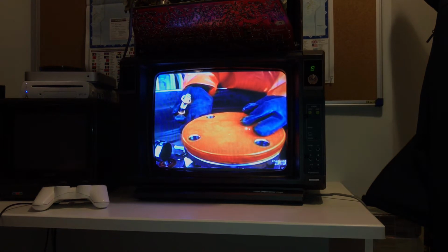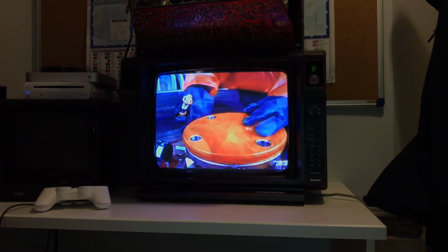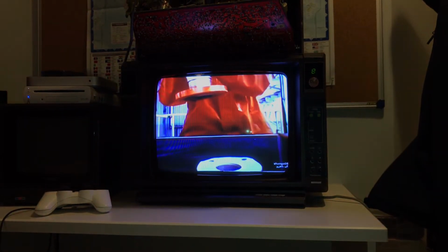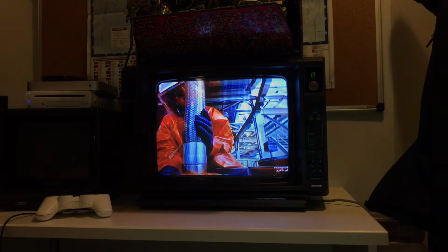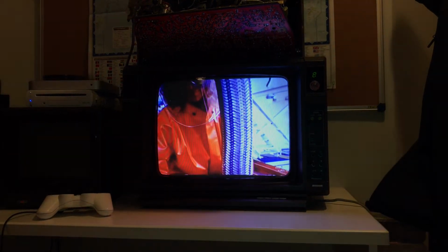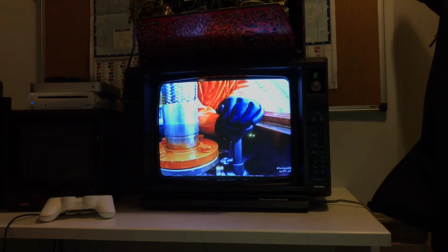If you are going to use the level probe, this is the time to connect it to the wiring harness. Now you can pull down the loading arm. And once it's perfectly aligned, insert the bolts. Make sure these bolts are torqued down good and tight. With the loading arm lined up and bolted down, you can go on to the critical step, opening the orange fill valve.